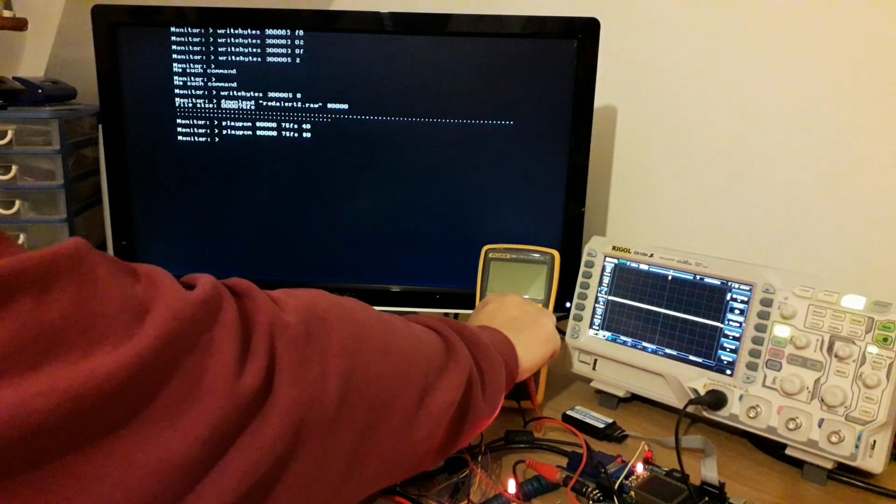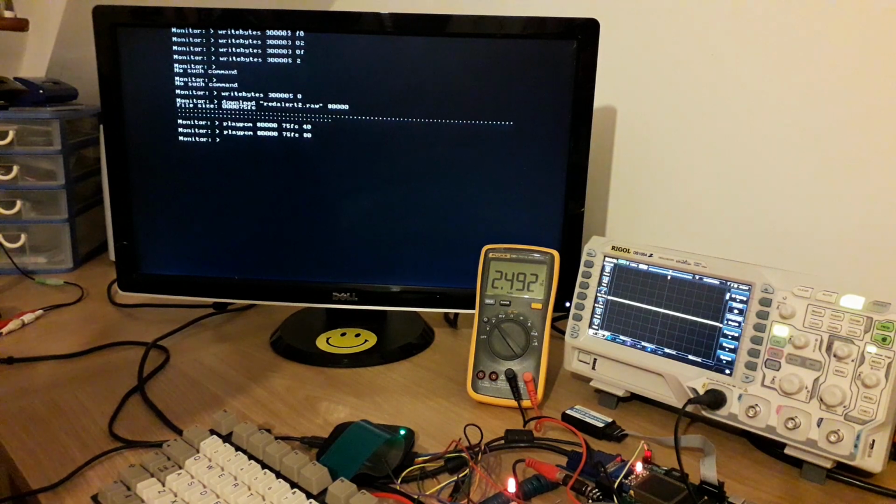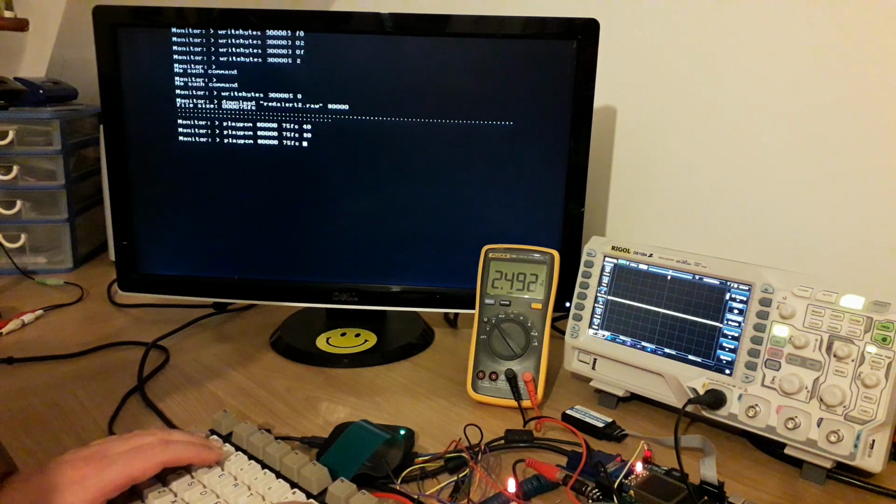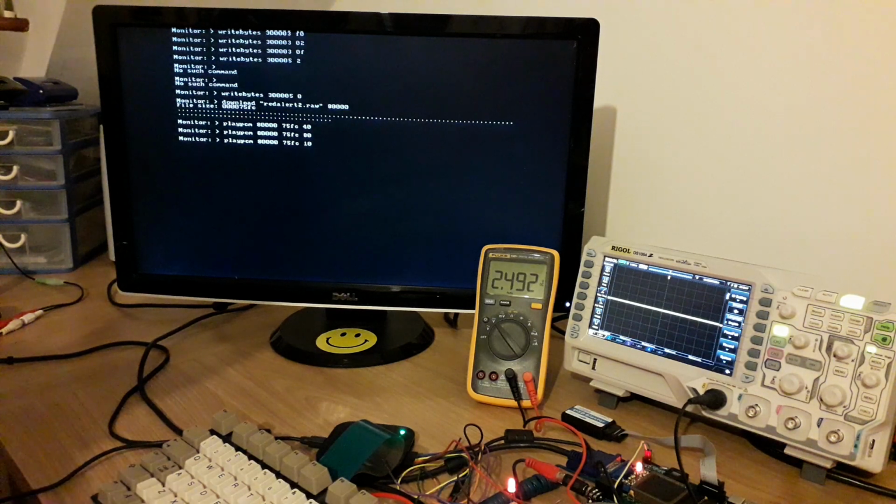And if I turn my multimeter on, you'll be able to see the value at that reference, because there's 2 channels, as I think I mentioned. Channel B is used for the volume, channel A is the actual PCM data. So I'm showing on the meter channel B, voltage to ground, and on the oscilloscope is channel A. If I play it very quietly, you can see now it's at 2.5 volts roughly. Okay, now it's dropped back to 1/16 of 5 volts. Can't be bothered to get my calculator, but that should be roughly what the 0.3 volts is.